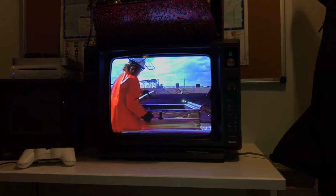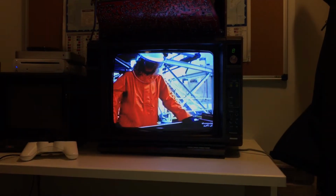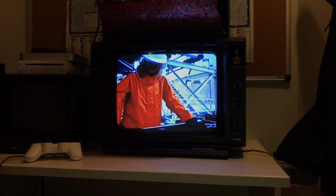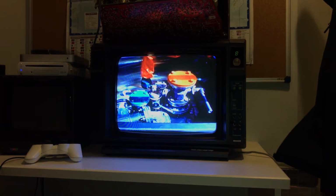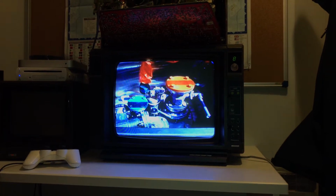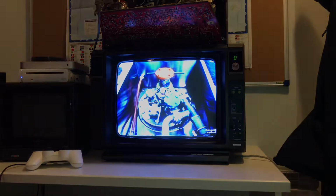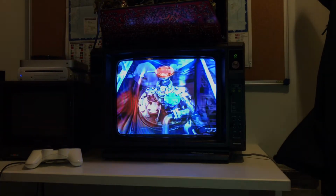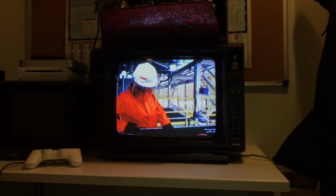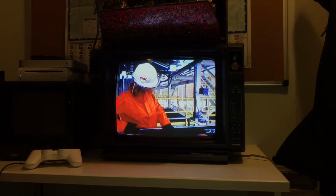An FMC loader is going to be controlling the flow of sodium cyanide into the truck tank. But first, you have inspections to make. These are for your own safety because you will be the person doing the connecting and disconnecting of loading lines to the valves on the dome and the pumping station. The time to find out if there's a problem is now, before you have a tank full of cyanide. When you're satisfied that the vehicle is ready for the loading sequence to begin, only then will you start actually connecting the loading line and opening valves.